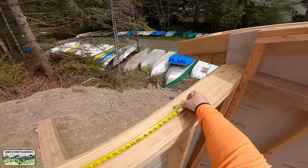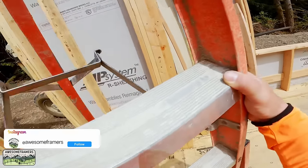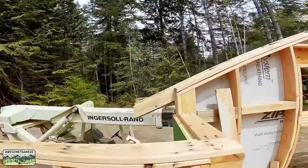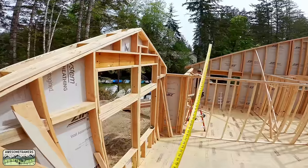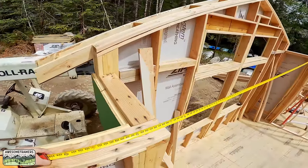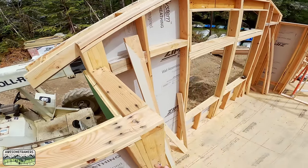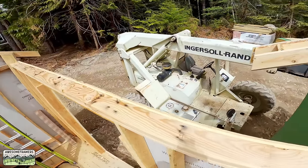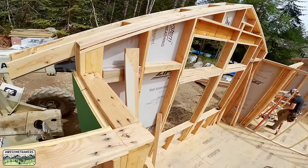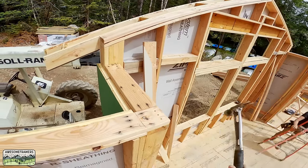Here we frame our roof at 24 inches on center. So butting the exterior foam, in this case, the insulation, that's the corner of my building, 23 1/4 rafter long. I won't move my hand. Pulling layout evenly all the way through the back ensures that even though we're going to frame up and over that room in front of you with an overframed roof, all of the jacks will still land on 2-foot centers, making our roof sheathing easy. So that works out pretty good. One more thing to note, I have 2 studs nailed there at the corner. That's because we're using the Zip R6 panel, which is 1-inch polyiso foam plus the 7/16 panel, so you need additional backing for your corner trim.